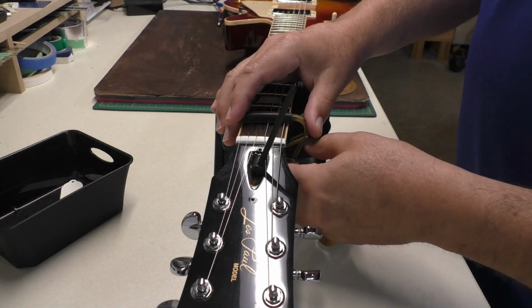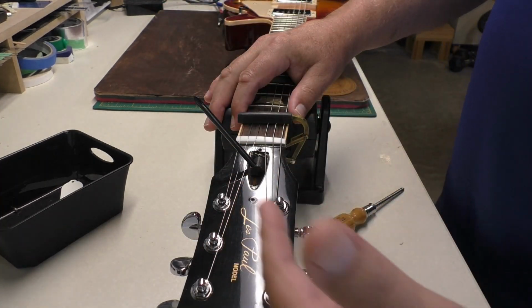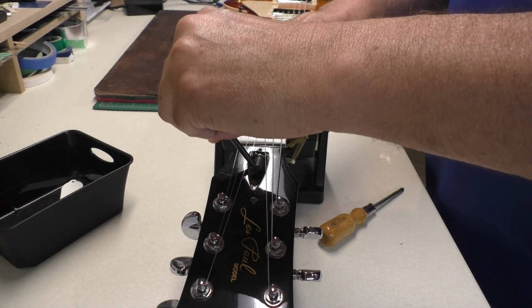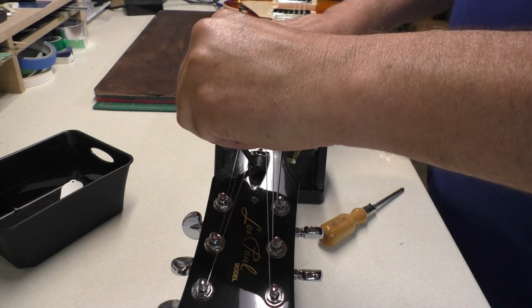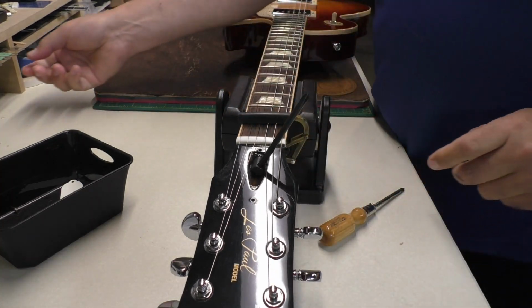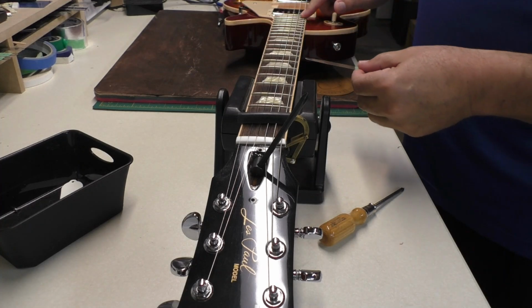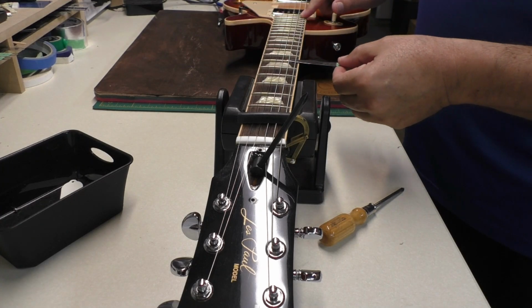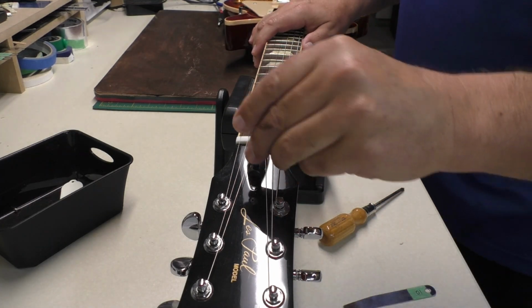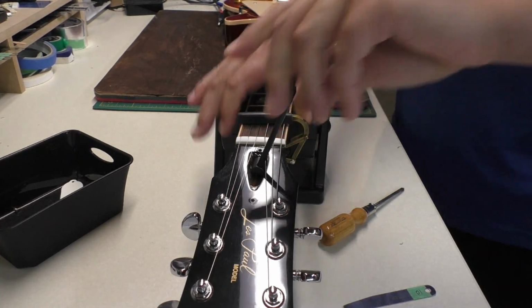So we want to tighten this up. So we're going to go clockwise. Righty tighty as you look at it, right? Lefty loosey. So I'll start with about an 1/8. Oh, that's pretty stiff. Yeah, about an 1/8 of a turn. See how that goes. We'll try 10 thousandths. It's not touching. It's moving though. Try it again. Another little turn. There we go.